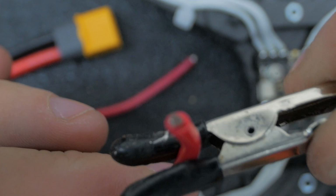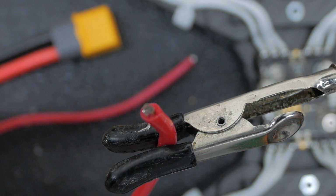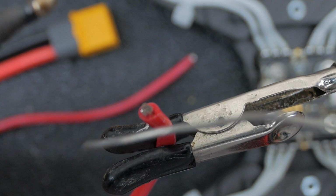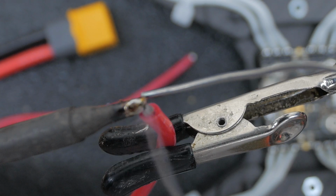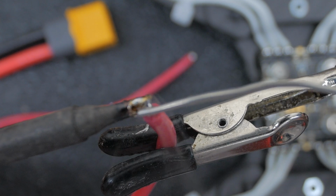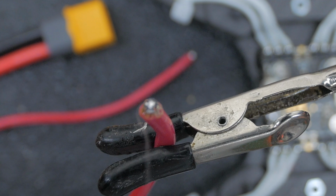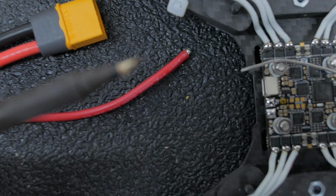But when you're using a little cheap soldering iron like this, a TS100, which they kick ass, don't get me wrong, compared to the one I use at work, you need to do a little extra. So I always start by touching it on the wire, and then work my way around to where now I'm not touching the soldering iron, I'm touching the wire, and it melted in. So then from there, we could get you focused down there.